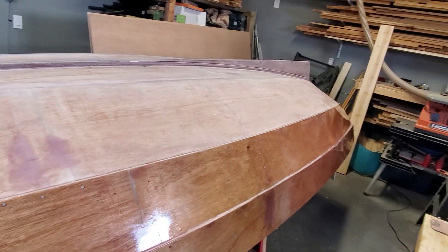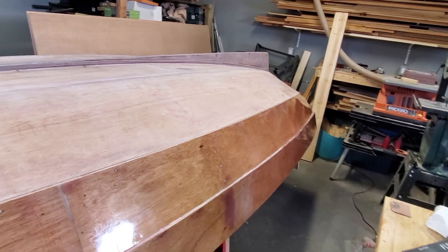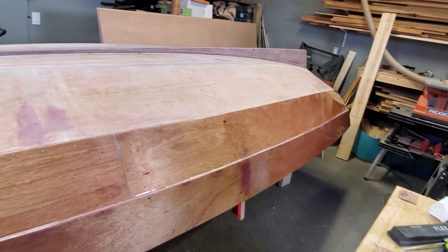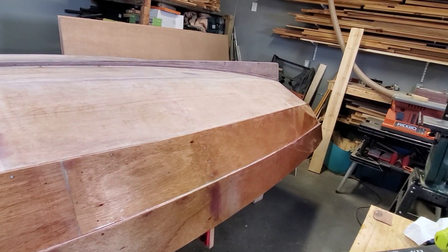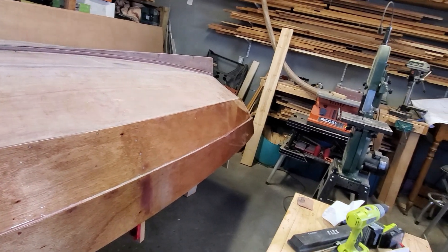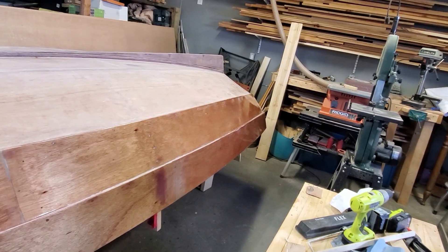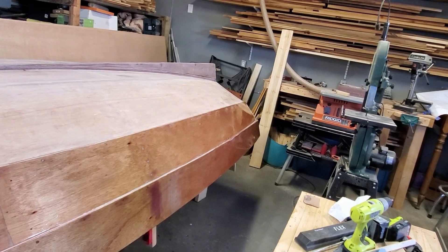What you see here is the first coat I applied earlier this morning, about three hours ago, and I'm ready to apply the next coat while it's still green. Because the first coat is still tacky — it remains so for several hours even with West System Fast Hardener — you can go ahead and apply a second coat directly on top and it will chemically bond to the epoxy. If you'd allowed it to cure longer, say six hours or overnight, you've missed your window for a green coat, and you'd have to sand the hull to give it mechanical tooth for the second coat to adhere.